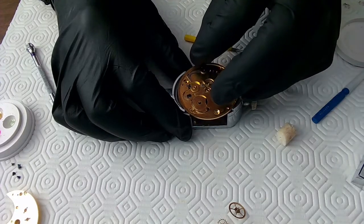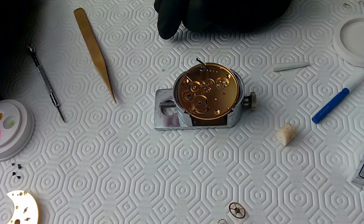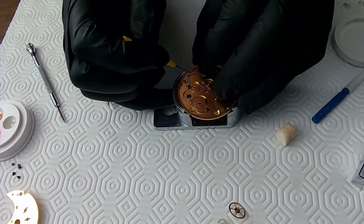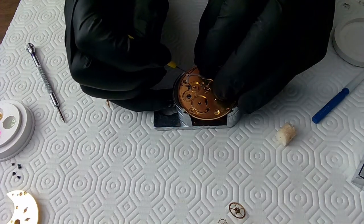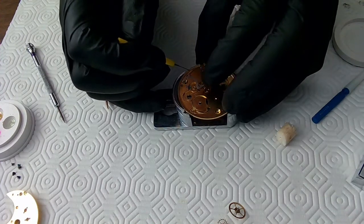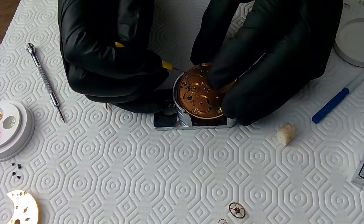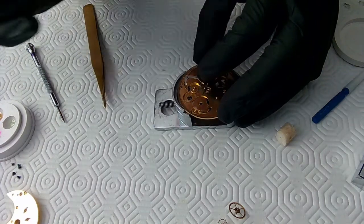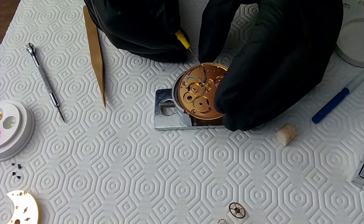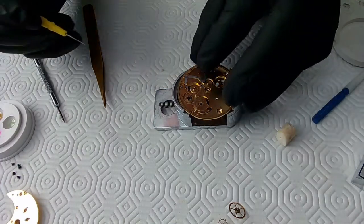And then I want to make sure that there's a little bit of oil, and I'll use the red stuff again for the inside of this spring, where it catches the part here. That way there's a little bit of freedom of movement. It does seem to be a little bit stiff coming around here, which means pulling it out will be fine, and I just have to flick it back with my finger. That's because the surface area here seems to be just a bit rough. Looks like it was ground or something in the past. Somebody may have done something with that in the past.